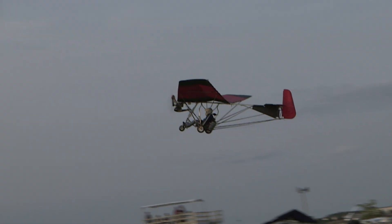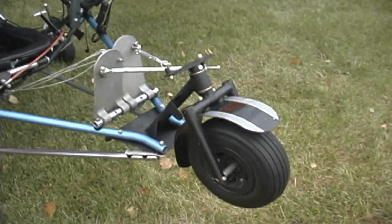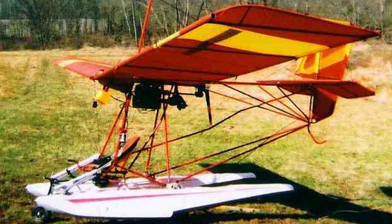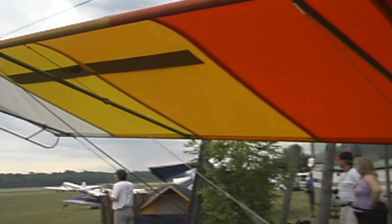Now there's a special story on this one. You've got a 1981 Quicksilver? Yeah, it's a 1981 Quicksilver. It's not totally original — we picked it up last year used. I put a big man bar that you see here on it, and I added a steerable nose wheel. I added wing fences because I'm a little bit on the heavy side — the guys that fly the MX's on pontoons put these wing fences on. I also added one wire out to the wing tip, which I figured increased my lift somewhere between 8% and 10%. It had the original maple prop supplied by Quicksilver, which was a little inadequate, so I put a new prop on it as well.